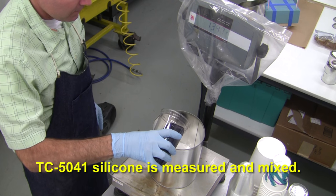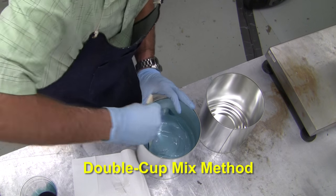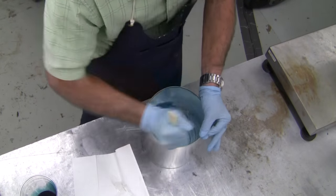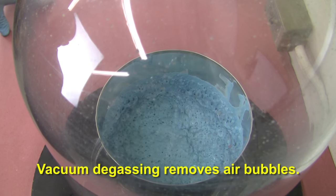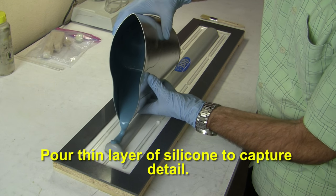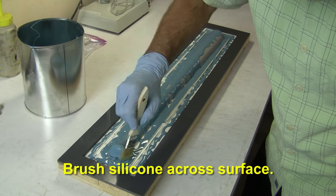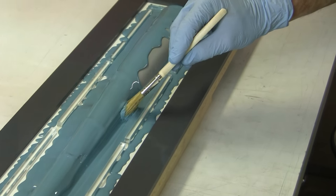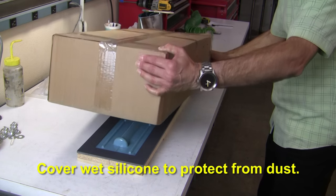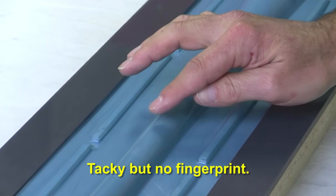We'll begin to measure and mix up a batch of silicone for the flexible inner mold skin. As explained in our other mold making videos, we use the double cut mix method to ensure a proper mix of silicone. A streak of unmixed silicone in our first layers would be a disaster for our mold, so keep that in mind. Once fully mixed, we place our silicone into the vacuum chamber and remove trapped air bubbles — we want to minimize the chance of bubbles on our first layer. A thin layer of silicone is poured over the surface of the pattern and flange area. A small brush is used to spread the silicone across the surfaces, and brushing slowly and firmly will help dislodge any trapped air in the sharp corners. Once finished, we cover the pattern to prevent dust from settling on our wet silicone. After waiting for the silicone to gel, we test to see if the surface is tacky but won't show a fingerprint.